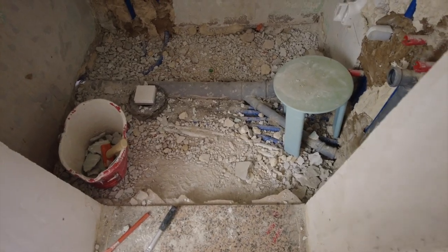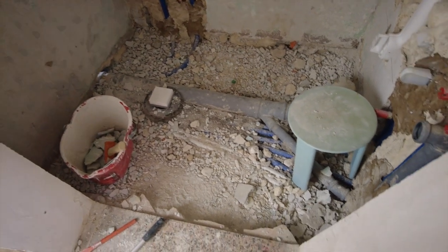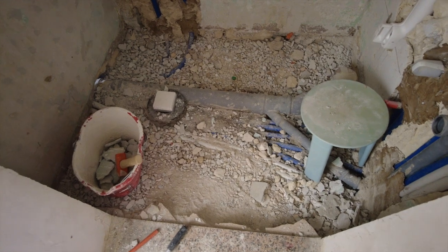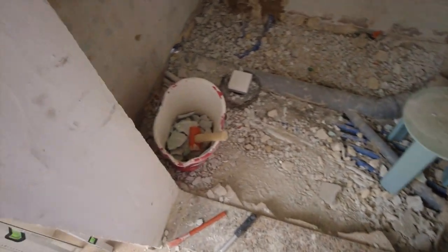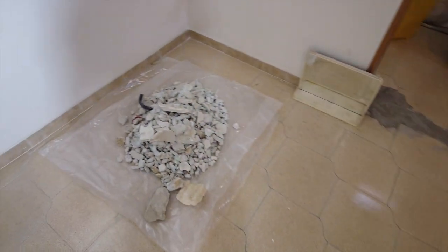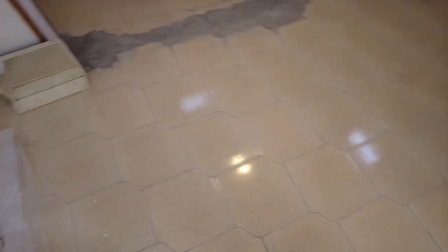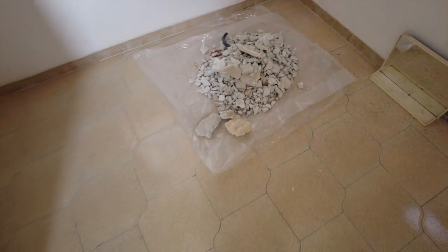I think I'm done getting the plaster I needed off the walls. Quite a bit of it fell on the floor — that's fine. I may pound some more up and crush it and use it for fill, since I only need a couple of inches of floor screed. Got a little bit in that bucket and a nice big pile right there. Each one of those was a bucket, so one, two, three — and that was two buckets — five of those red buckets total.